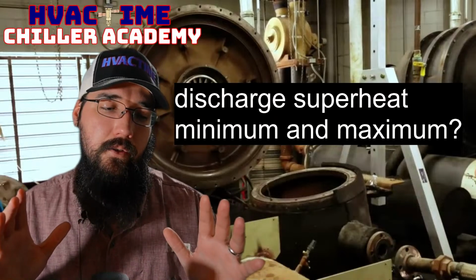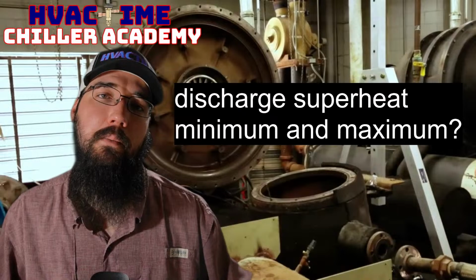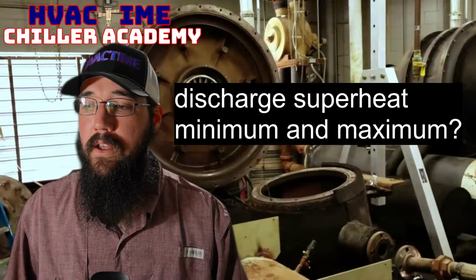So that is a condition that we really, really have to be mindful of. And I'd much rather run high discharge superheat than run a low one any day of the week.